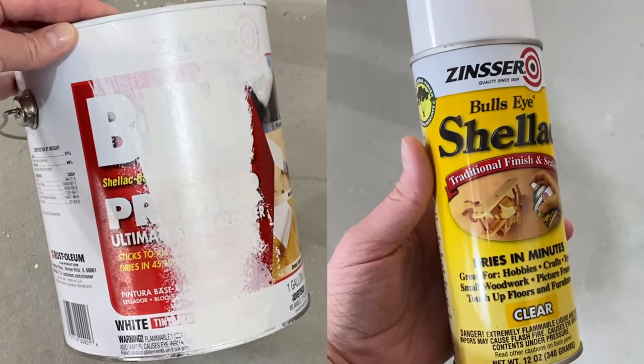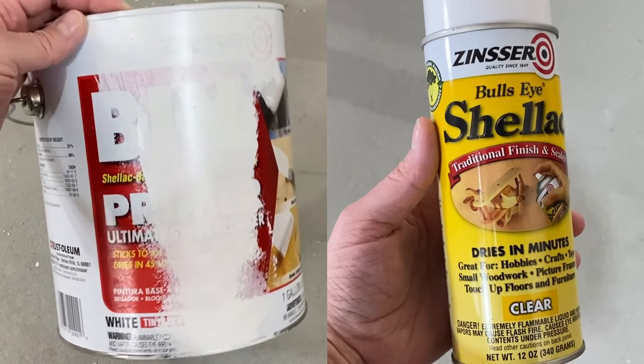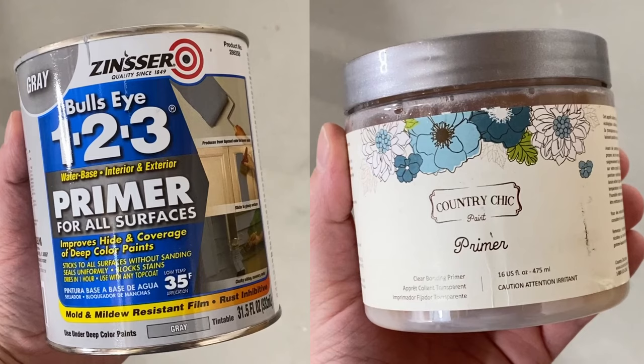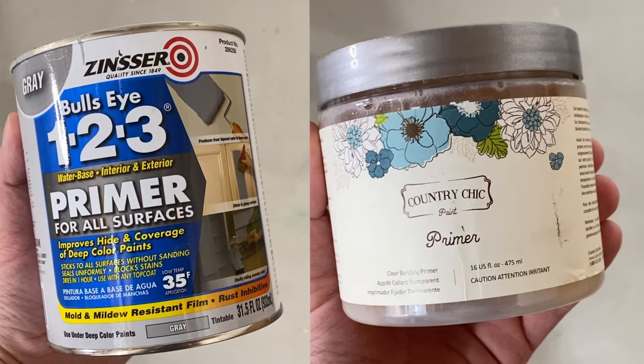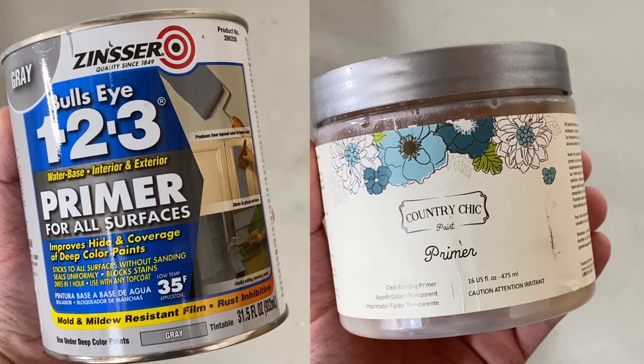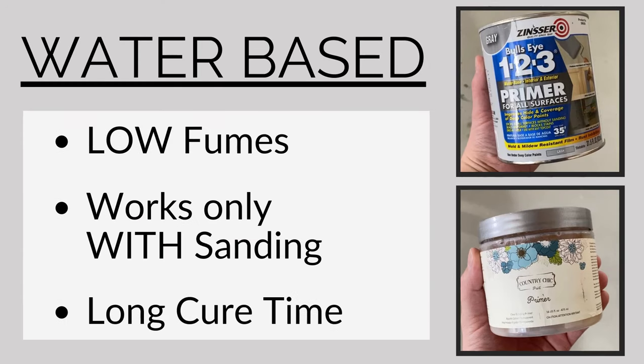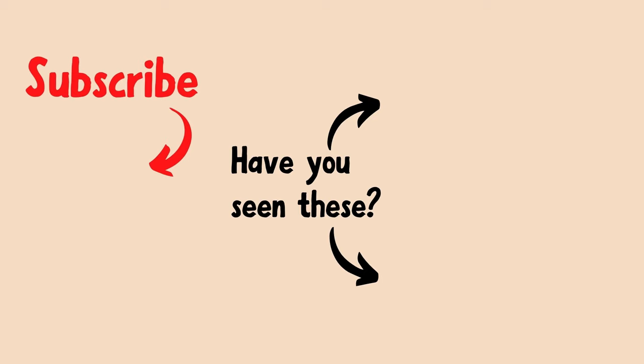So in the end, I think you just have to weigh your options. The best overall winners for the scratch test were the Bin Shellac-Based Primer and the Clear Shellac Primer, both with and without sanding. The Bullseye 123 Primer Tinted Gray and the Country Chic Paint Bonding Primer both worked great when sanded before priming. I think if you let the 123 Primer and the Country Chic Paint Primer cure a little longer, the results would be the same as the shellac primers. On one hand you have quick shellac-based primers with fumes but no sanding required. On the other hand you have water-based primers that take longer to cure and require sanding, but have very little to no fumes. If you thought this video was helpful, please hit that like button and subscribe for more. I'd love to hear your experiences with these and other primers on laminate furniture.